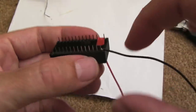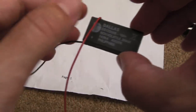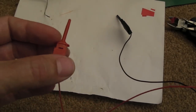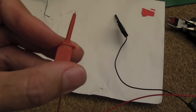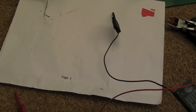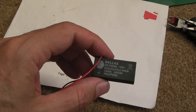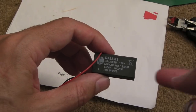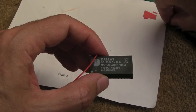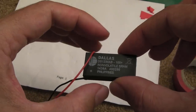Pin 1 can go straight into the socket edge — that's not a problem, it doesn't connect to anything on the board. I've extended the wire; originally I had a shorter wire going to IC14, but actually the write enable pin needs to go to IC77, pin 8. That was 1024Mac's advice — I'll stick his name up here. He's one of the nice guys over on Stardot Forum. If you're going to do anything with the BBC I'd suggest joining the Stardot Forum, because there's an awful lot of experts on there with decades of experience modding, supporting, and developing software for the BBC.